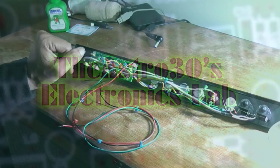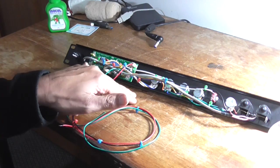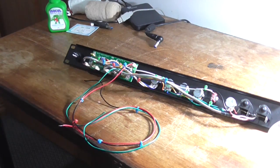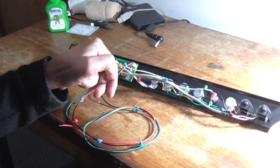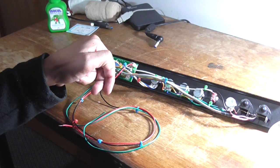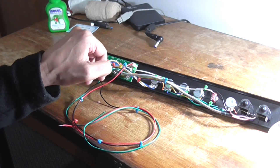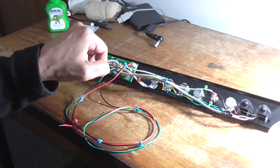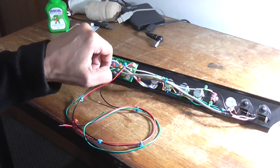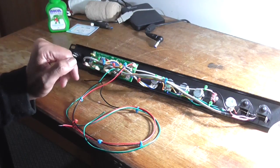Greetings, the Astro 30 here yet again, and I'm looking at this Elliott Sound Products preamplifier for guitar. The master volume control is very touchy. Right down at the very end of its travel counterclockwise, you can actually hear distortion coming through from the other high gain stages. Then when it's rotated slightly up, that distortion goes away. It never reaches absolute zero, and then when you turn up a little bit further it's almost like it's full on. There's no variance there as there should be.